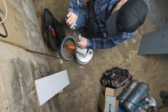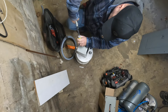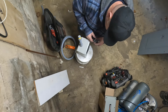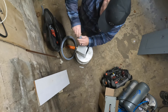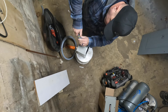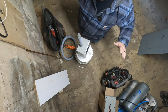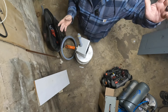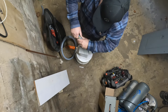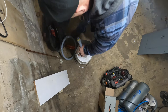The inspector in this town is pretty cool. When I first called the electrical inspector, I mentioned there was a panel inside the kitchen that was there before I got here, and he said there's no problem leaving it in the kitchen. That's where the new sub panel was. The old main breaker panel was down here in the basement — they left the panel there, put the cover back on, and used the old enclosure as a junction box to extend all the branch circuits to the new sub panel in the kitchen, most likely for convenience, since you have to go outside the house to access the basement.